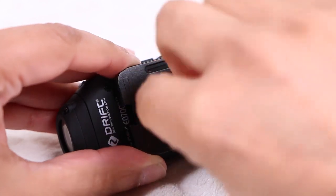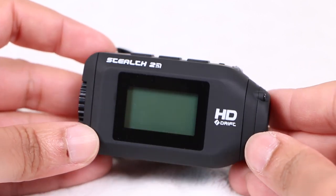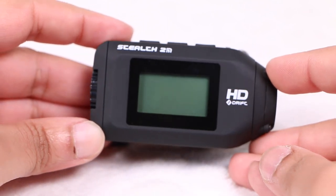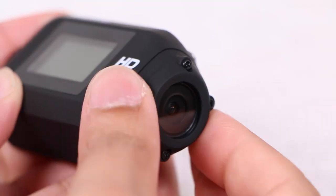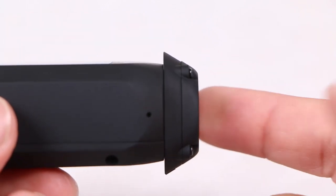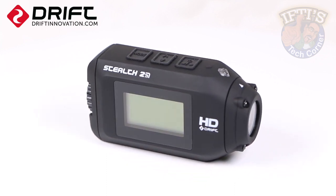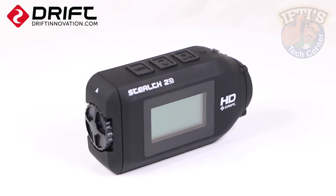Drift has clearly done its homework here. Mounting is tough and well designed, as is the main unit itself. The Drift Stealth 2 features a toughened screen, rubberised buttons and a screw-in cover for protecting its ports, although note that it's not completely waterproof — it'll survive the odd shower of rain, but not complete submerging. The only real concern is the rotating lens; leaving it partially rotated leaves lips that could get caught in a tumble, and having electronics twisting round can't be ideal long term. Also note that the 1500mAh battery is internally mounted and not replaceable, although it should provide around 3 hours of recording time on a full charge.